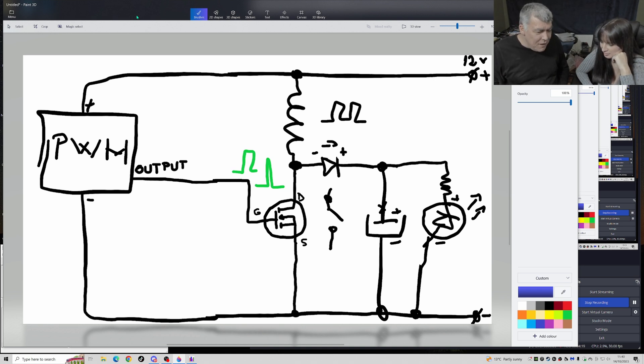So how can we use this resistor on the schematic? What is the idea of the resistor? The resistor will drop voltage - on one side of the resistor you'll have a different potential compared to the other side. Where can we insert a resistor on the schematic to have a current sensor? One suggestion is between the diode and the capacitor - smart idea but it doesn't really work on this particular boost schematic.